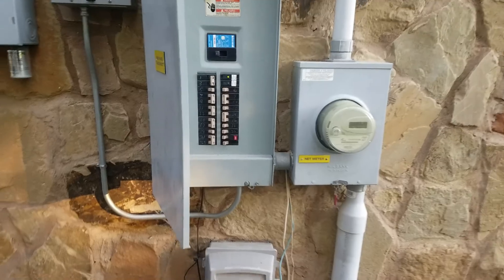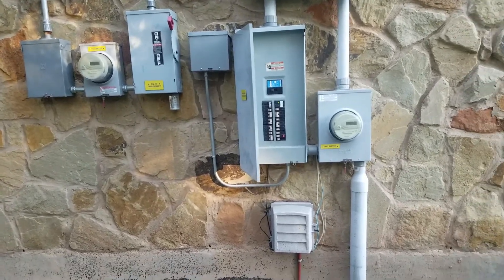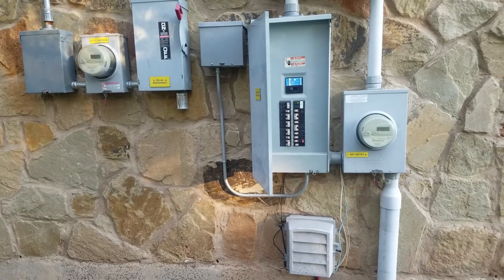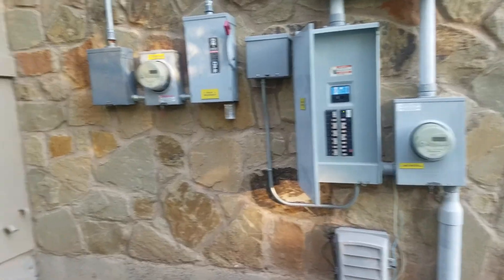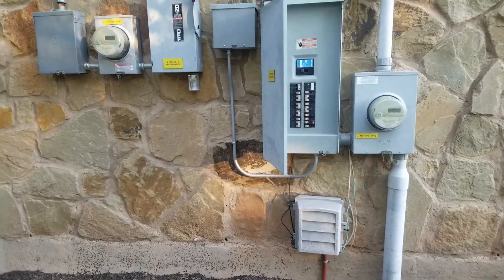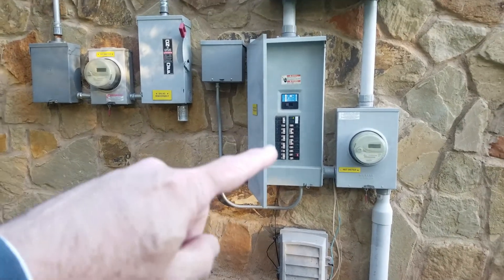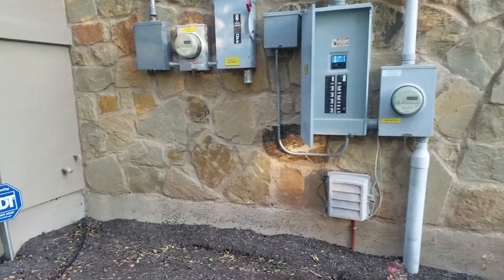My generators are 30 amps, and that's not enough to power the whole house, but it's enough to power every individual thing plus some others — except for the large air conditioners, which take 33 amps. I didn't want to put in a 50-amp; it's heavy wire and costs a lot more, and I'm not trying to be off-grid. I'm just trying to survive when the power is out. I'm going to put 30-amp breakers and a 30-amp plug inlet box. I was going to use 10/3 wire but I did a voltage drop calculator online and it dropped around 6%. I decided to go with 8/3 wire on the 30-amp, which reduces the drop significantly. It costs a little more but it's okay.